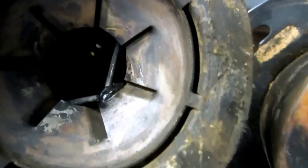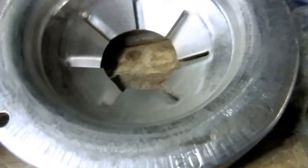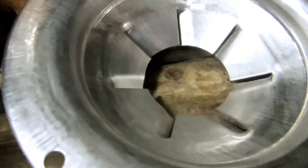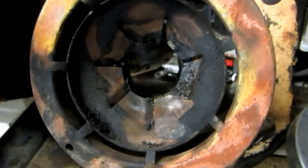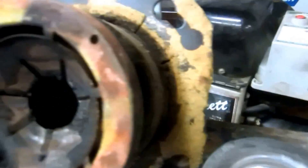This is like an F6 — see how big the slots are. This is a standard, probably an F2 retention head. Obviously that one is going to take a bigger nozzle than this one. And this one here has no slots, which I don't like running — this is for a tiny little furnace. Those are some of the different retention heads. This is what they call a retention head, which I like using myself — less trouble. They do have different types of heads for Becketts.